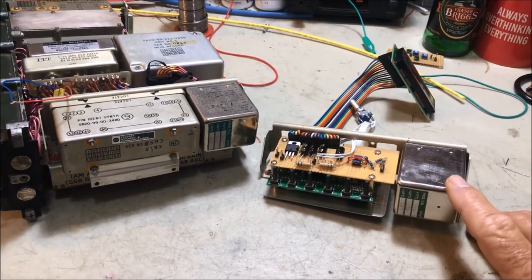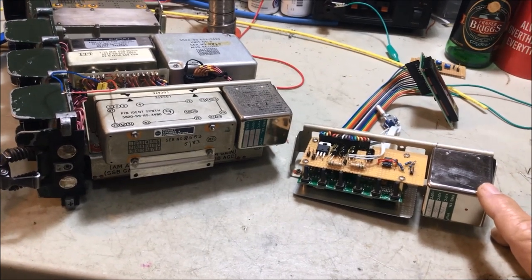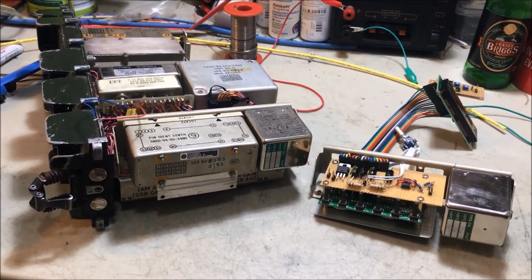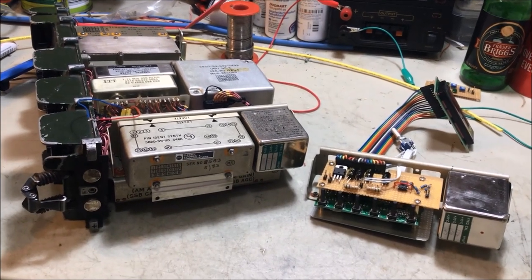the existing unit here, which is 1.75 megahertz sinusoidal, to the chip that'll be mounted under here, which is 1.7468, which is the lower sideband. So I'll be able to do it that way. So that would be the second option.